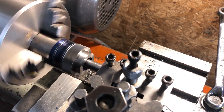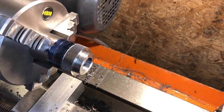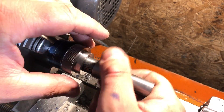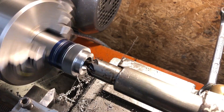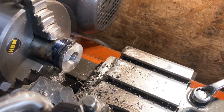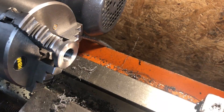I am aiming for a close-ish fit on the spindle, so once I am within a thou or two of book depth, I am trial fitting the part each pass. As soon as I feel it begin to thread on, a couple of spring passes bring it to size. Facing to final length, a couple of chamfers and a countersink, and I can part this off. With the part reversed in the chuck it can be faced to final dimension, another chamfer and countersink, and this part is done.